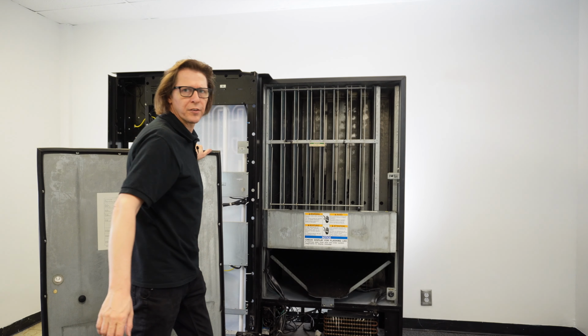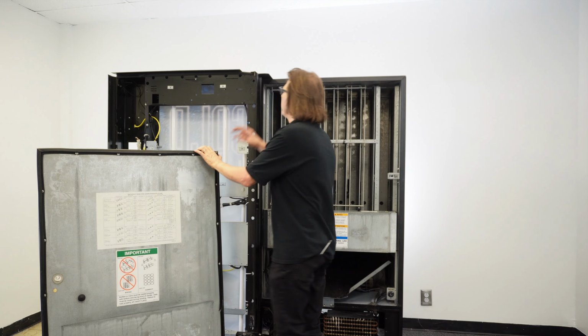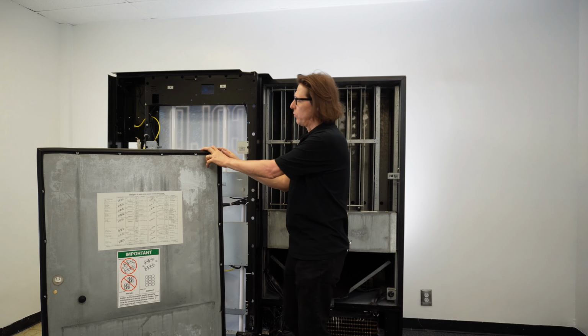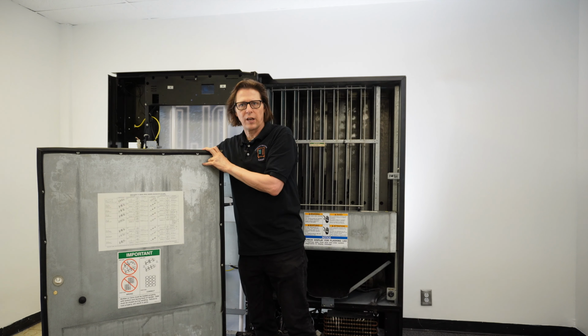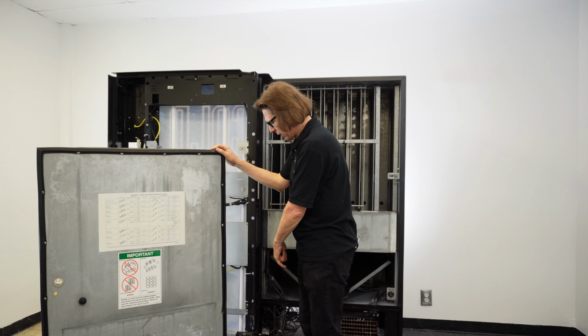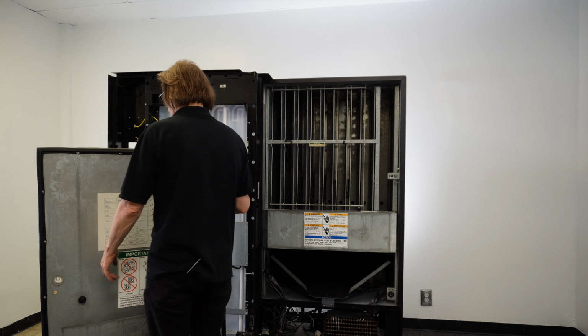Now that I got that nut assembly tightened down, I'm going to go ahead and reattach the inner door. So I'm going to go ahead and slide it onto the upper hinge up here, and then I'm going to hang the left-hand side of the inner door onto the T-handle shaft and kind of use it as a balance where I can get down here and put in the bottom hinge. So the trick here is, this is the tricky part.